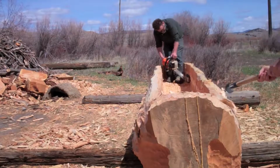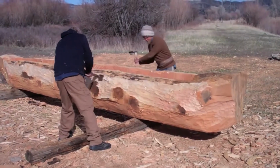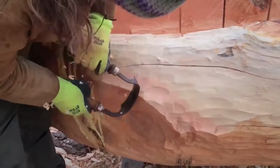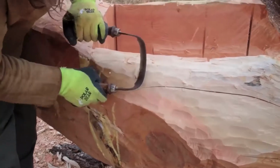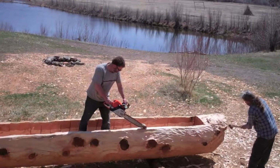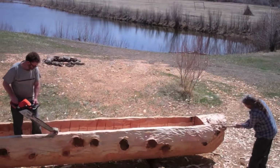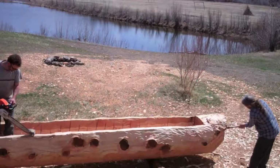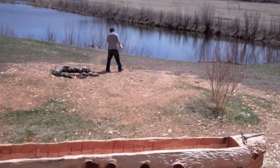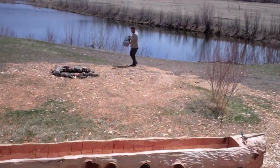About a week into this project, and you gotta admit, it's really looking good. That deep chainsaw cut in the back went all the way through in one spot, which required some Gorilla Glue to seal it up on the outside, but we filled the entire crack with epoxy from the inside. We systematically reduced several thousand pounds of wood to wood chips and sawdust, which we then raked and sprinkled out into the grass, especially where the grass was thin, to serve as mulch to hopefully hold in moisture and encourage the grass to grow stronger.